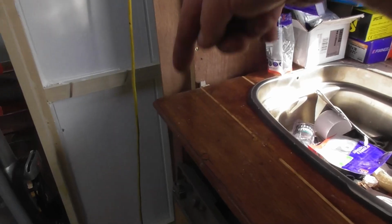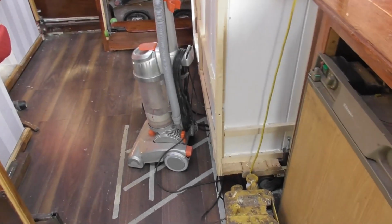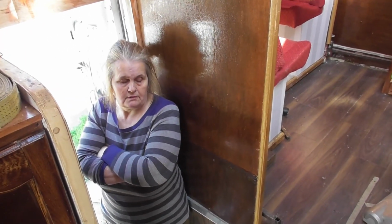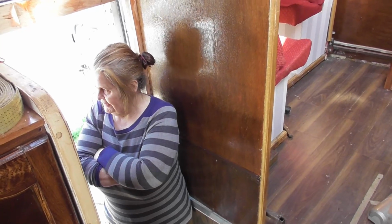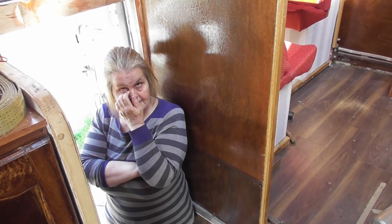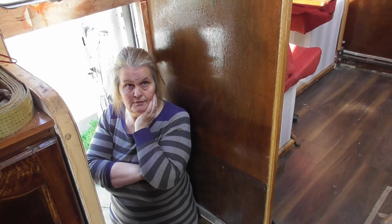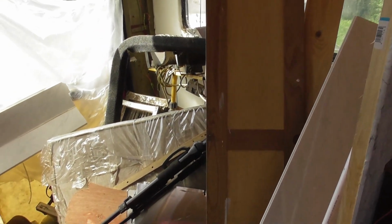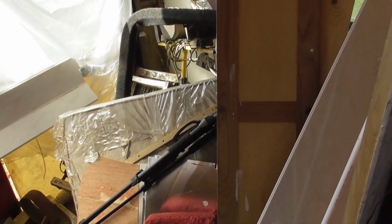So when you turn the tap on and water goes in there, it will fill that sump up first, a little small, say like stainless steel tank or something. I've seen the way I can do it. And if I have an open tank, if the pump packs up, it's just going to overflow the thing, and that won't cause problems in the shower room. So I might do an open tank, separate open tank, and cut a hole out in the floor at the back, which is not what I had planned at all, but I don't see any other way around this.